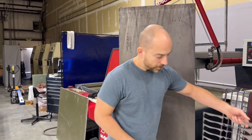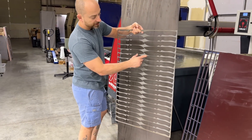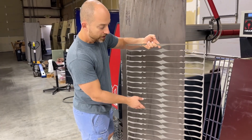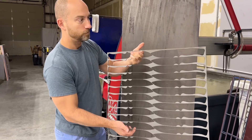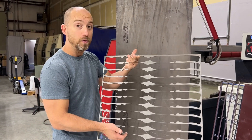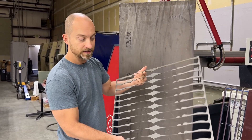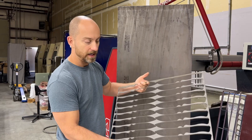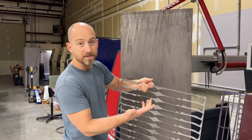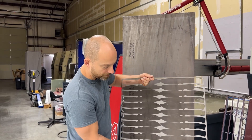If we look at this sheet of MagnaCut here, this is about as efficiently as we could nest things on the GSO 5.1. We looked at tucking the tips in a little bit, but it didn't really net us enough extra material along the side of the sheet to do anything useful. This sheet still weighs 10 and a half pounds, and these materials are $25 a pound — so this is a lot of waste. This is $250 to $300 in just scrap now. We paid for it and we're just not going to be able to really realize anything out of it. We will take a look and see if maybe we can make some bottle openers or swag just to utilize some of the little tidbits, but so far we haven't come up with much of anything useful.